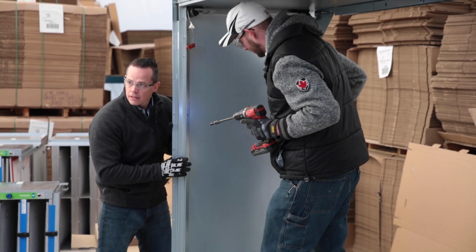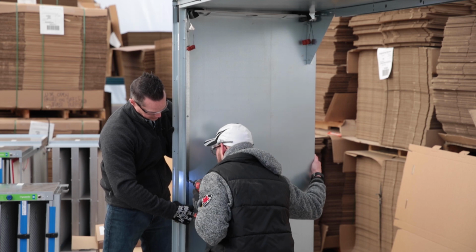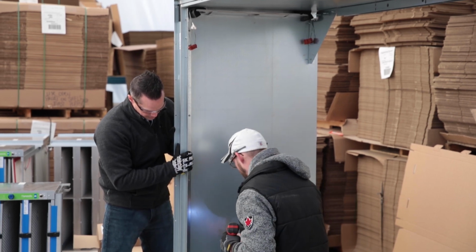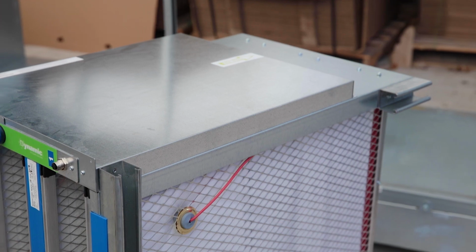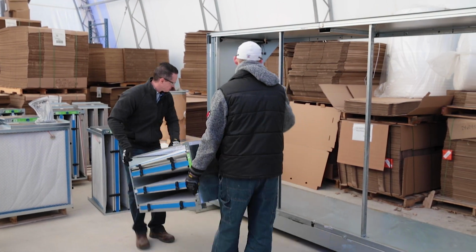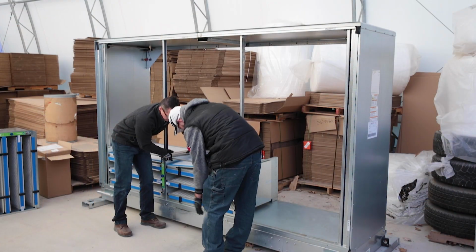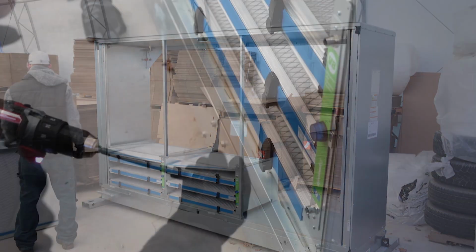If the end modules are less than 1.5 inches from the sidewall, no end posts are required. If this is the case, now install the blank-off angles on the sidewalls of the air handler. The modules are numbered, and a diagram is provided for proper location. With 2 people, place the first module into the proper position on the floor of the air handler. Install the remaining row of modules in the same manner, following the numbered diagram.